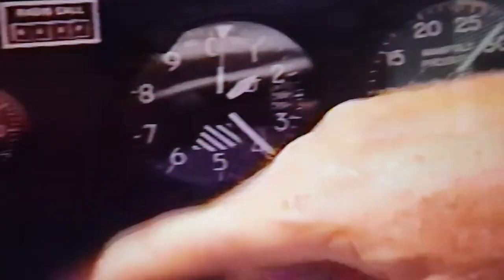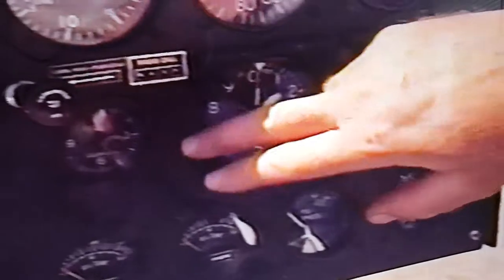We're currently at 1,393 feet, so the altimeter is already set for takeoff. I set the clock to track flight time as a manual backup for quantifying how much fuel I have — I zero it out and start it when I fire up the helicopter. My hottest cylinder tends to be number three, so I monitor that gauge most of the time, keeping cylinder head temp under 400 degrees Fahrenheit and exhaust temp under 1,300 Fahrenheit. The fuel gauge monitors both tanks so we can watch for clogs, airlocks, or other problems.